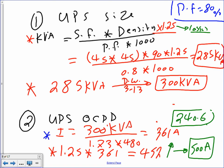That will be based on continuous load. I can't think of it off the top of my head. If you go to Article 210 or branch circuit, no, not directly. There's actually one on computer rooms in the NEC code book. It says under engineering supervision. That's what you're looking at, under engineering supervision. Can't remember, 645 or something. Why didn't you ask me this question in the lecture? You made me curious. I know there is one on computer rooms. Okay, how about we just continue with the sizing. Good point. Okay, 500 overcurrent device.